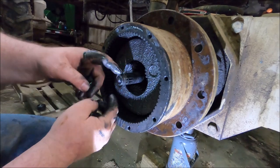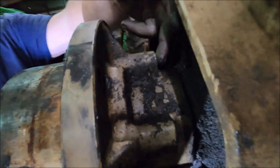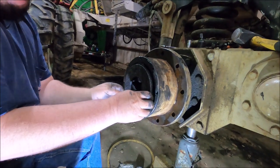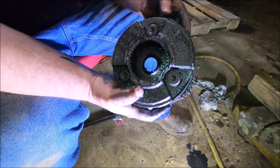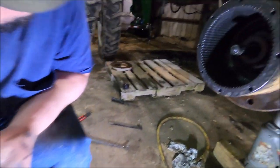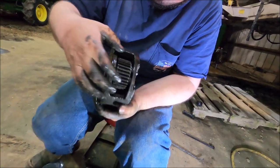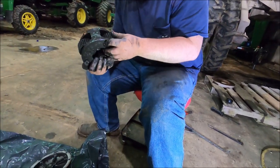I know it's gonna need a new shaft — that's gone. We removed a row of bolts back here on the back. I think that holds this planetary in. I'm gonna pull it out and see how ugly it is. There's a bunch of crap in there, but I think it could be cleaned up. Honestly, I think that big old bearing back there just gave up. I see this one row of bolts held it in there. There's a little steel, a little crumb.